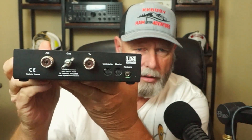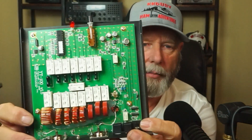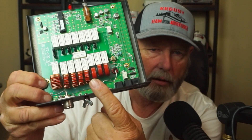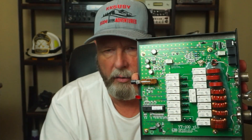Check this out. There are the connectors in the back where everything connects. You have your antenna in, your ground, and your transmitter right here. It also has some cords — there's a remote cord at the end there, and one of these goes from this unit to the radio. It's all automatic — the radio actually powers it on and everything. If you look inside, it's got a bunch of toroids down in here, all wrapped, and all kinds of little electronic components. A lot more electronics in this one. I think these are relays — so all the clicking you hear when it's tuning, that's all those relays going.